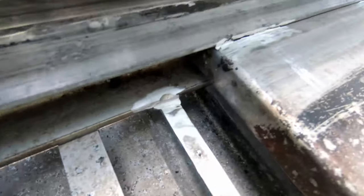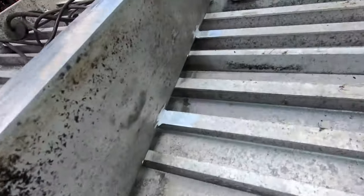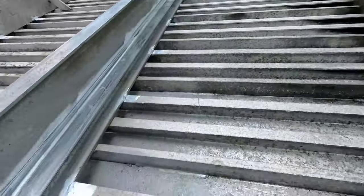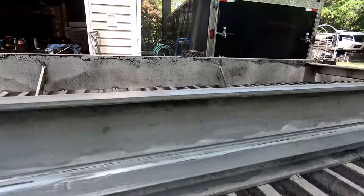On pretty good inspection, these are all the welds I got to fix on this side - there's a bunch of them on the same area on the insides all the way down. Then this is the gouge I was talking about - it's almost all the way through and it's probably like ten feet long. It's actually through here, you can see the crack where it made it all the way through. I'm going to use the Miller Multimatic 220 with an aluminum spool gun to fill that in.